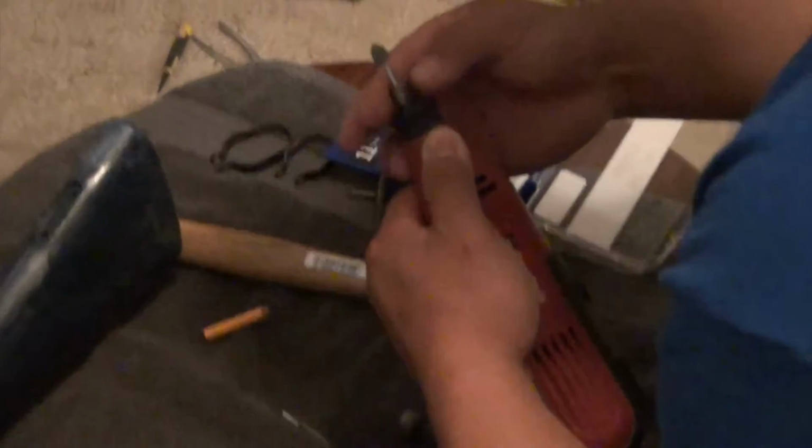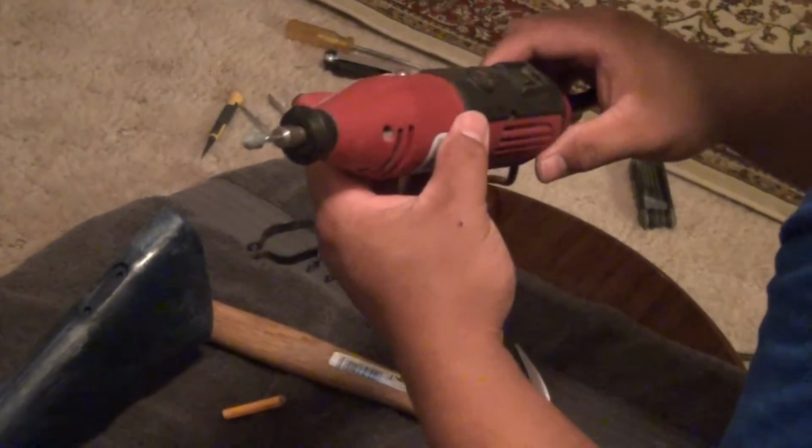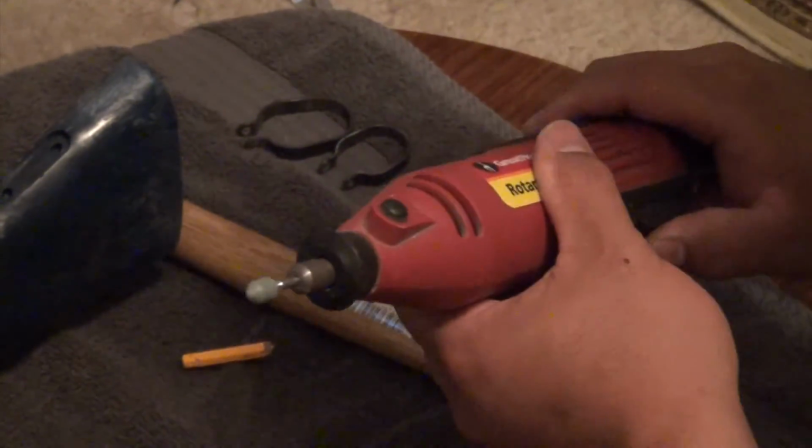The steps to assemble other brands of drill rifles are very similar. However, you will need to use a Dremel tool to widen the rear opening of the trigger plate. Be very careful shearing away only as much plastic as required to allow the rear receiver screw to align properly to the receiver.